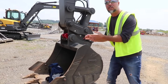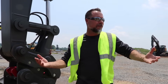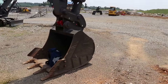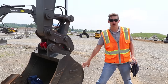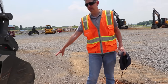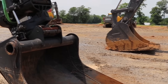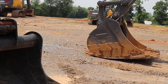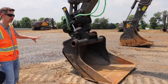If you're really that particular about your equipment, it's going to make a difference. This is a general-purpose bucket — the side plates only come up about half as high compared to the heavy-duty one. It uses the same hard-ox steel as loader buckets or rock truck beds, with about 40% coverage, which is why it's a general-purpose bucket. The one with the full chevrons has more plates on the bottom and higher coverage on the sides — about 80% hard-ox steel plate coverage — making it the heavy-duty bucket for rocks and quarry-type work. This particular bucket actually came from Steel Wrist itself, designed specifically for their attachment.